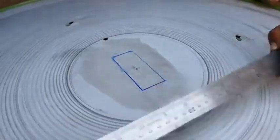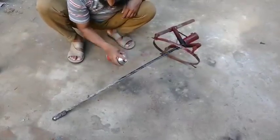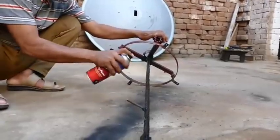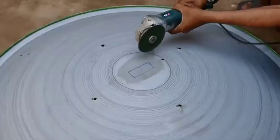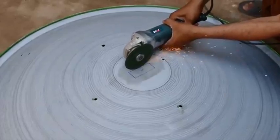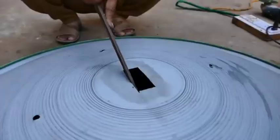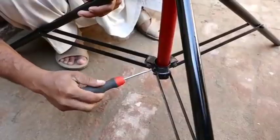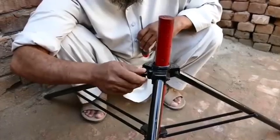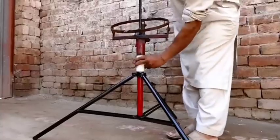Step 6: Finishing. Painting and coating: apply heat-resistant paints or coatings to improve aesthetics and durability. Polishing reflectors: ensure reflectors are clean and polished for maximum sunlight reflection. Packaging and distribution: pack the solar cooker with user manuals and any necessary accessories, then ship the products to retailers, distributors, or directly to customers. In large-scale production, automated machinery like laser cutters, robotic arms, and conveyor belts may be used to speed up the process, improve precision, and reduce costs.